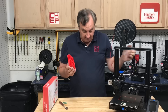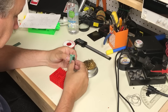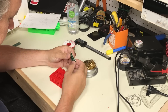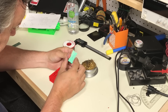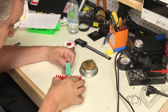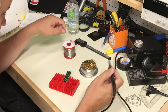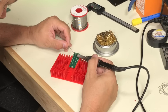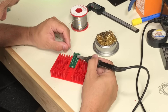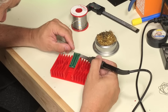Great spacing — it worked. Now for the real test: let's try and solder a socket to a board and hold it with this thing. I inserted a 28-pin socket into the board, bent the outer lead so it holds upside down, then put it into the spring vise to see if it'll hold it. I bring in the soldering iron and solder a few pins. It's holding it beautifully — I like it, and I can change the angle and do different things with it. So I think this is a winner. I'm going to keep this on the bench and I'm probably going to print a few more. This worked really well.